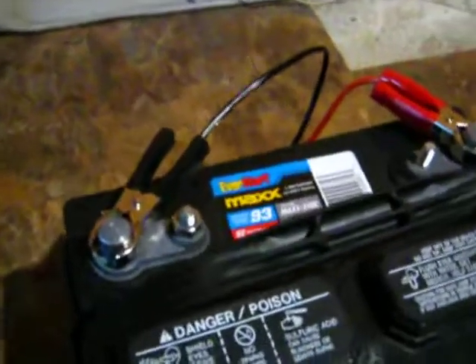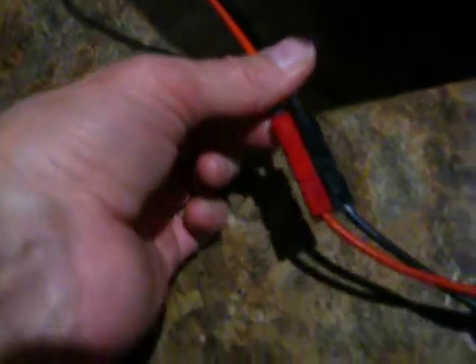To that we have a little adapter — just some jumper clips which lead to an Anderson PowerPole connector, going to my inline watt meter. There's a handy thing to have. We can see we're drawing 2.6 amps now, and the battery voltage is down to about 12.35.